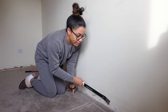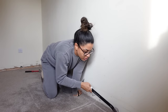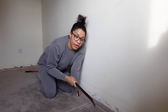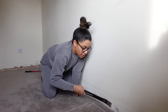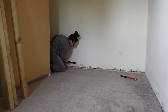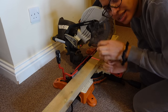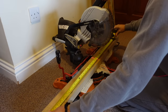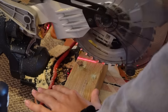I'm going to chip away at any big bits of adhesive left so that when I put the wood base against the wall it is totally flush. When measuring, you need to account for maybe the two millimeter thickness of your blade - align your wood either side of that measurement so you always get an accurate cut, otherwise you'll start getting confused as to why things aren't lining up, and it's probably because of the mitre blade.